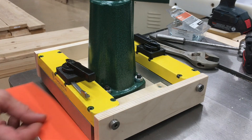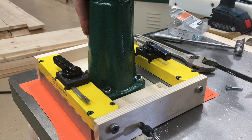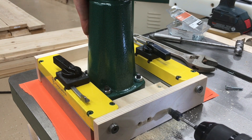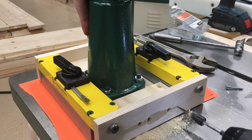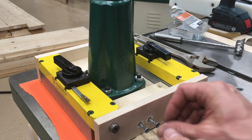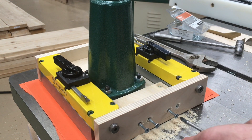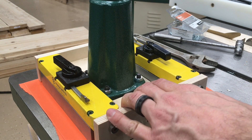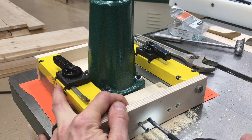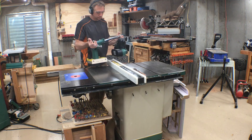The really only nuanced part of this build is when you join the wood that holds the magnets to the wood that mounts the base. As I'm doing this, I've got two pieces of construction paper underneath the magnets so that they're just very slightly raised above the table. If I line everything up and drill a couple of holes to lock everything in this position, then when I clamp those magnets down, they'll still reach the table. That thousand pounds of force is going to overcome that tiny little air gap, but there's a little bit of compression built into the system for a good firm fit with the table.